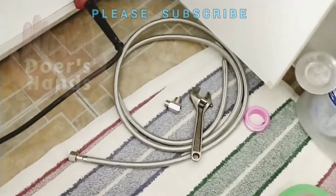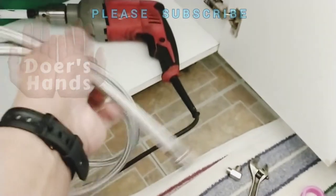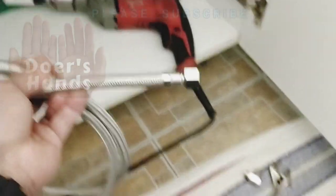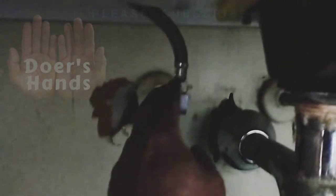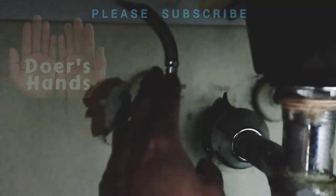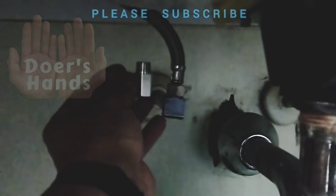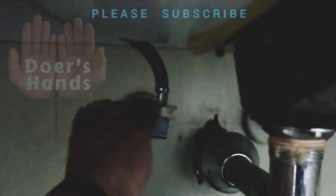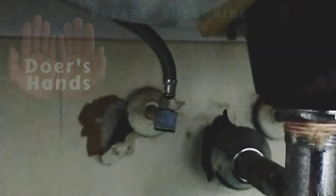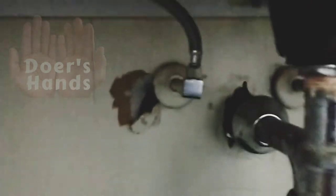Okay. Now I'm back to continue working on this bidet connection. I'm going to connect this line for the hot water to this fitting. This is a hot water line. That's where this T connector will be. Just like that. We will remove this, but I will need to turn off the hot water valve so that there will be no water coming out there.